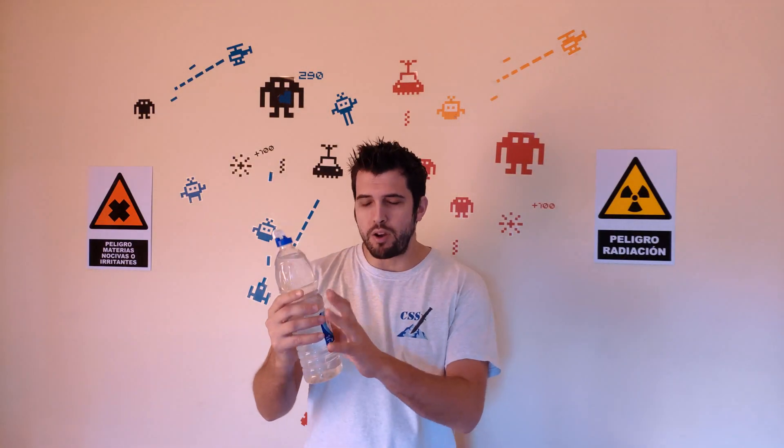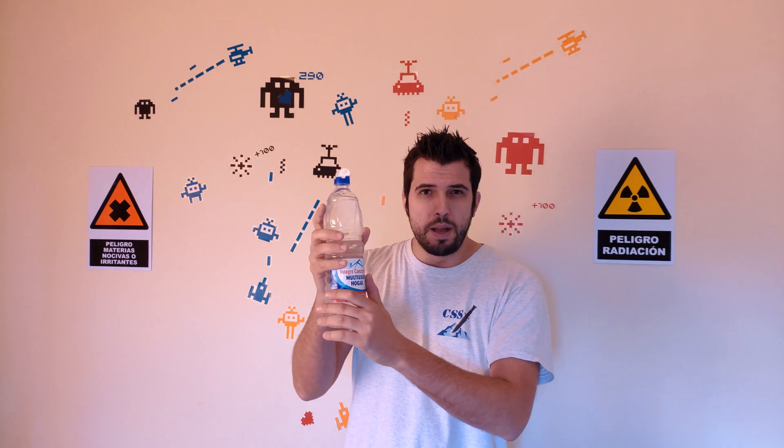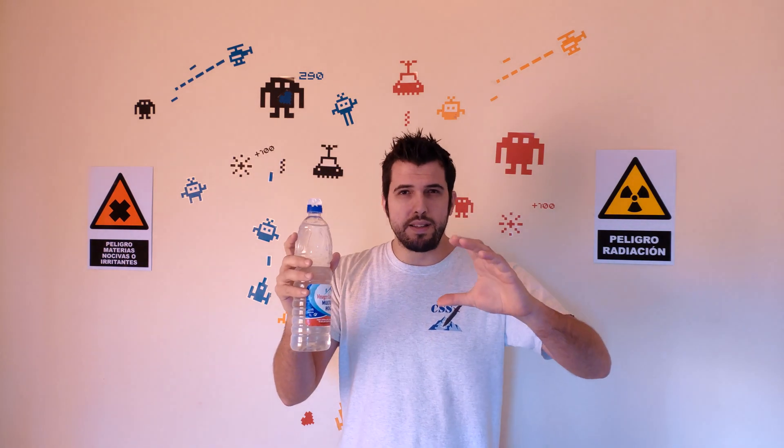I have already prepared a nickel acetate solution that is made with vinegar by making electrolysis between two nickel bars. Let's see first how to prepare the solution and then we will nickel plate all the stuff. We are going to use concentrated vinegar — you can buy it in any store.